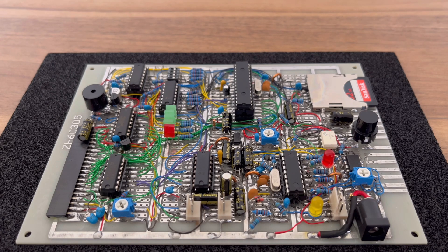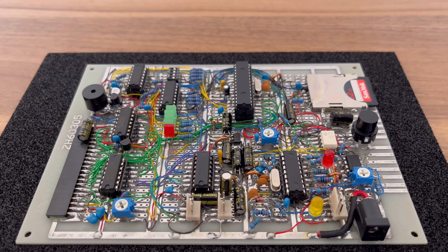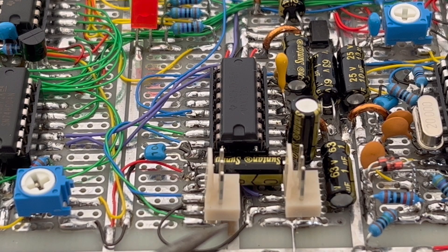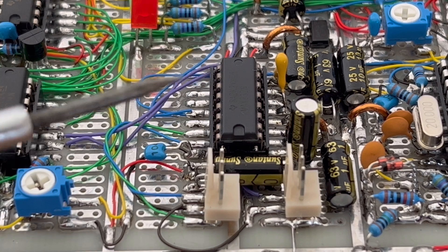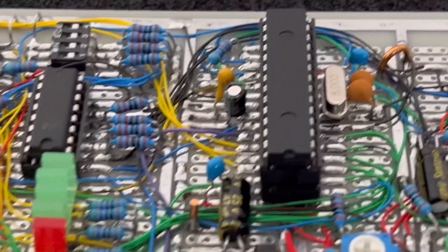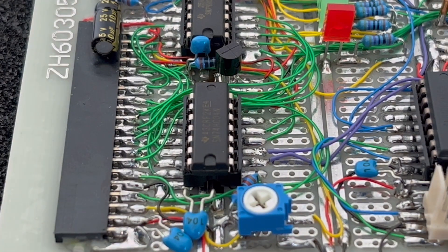Things aren't always as simple as you want them to be. To facilitate connection directly to an RS232 serial port on a computer, Garmin inverts its serial line electrically - when idle it's low, whereas normally a TTL level signal on a board would be normally high. Since it's inverted on the hardware side, a change had to be made. I've added the GPS serial port, and the only violet wire on the board runs from the plug, underneath a chip, back out to a spare inverter gate, and then back out to the DSPIC.